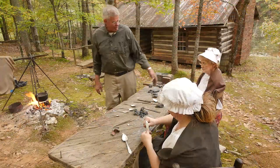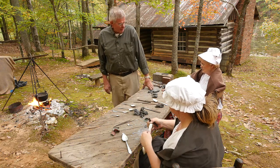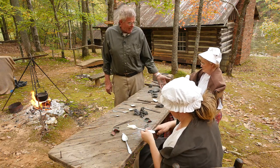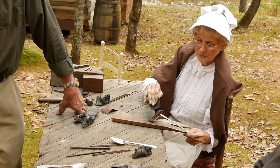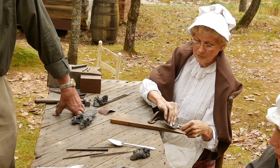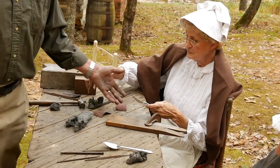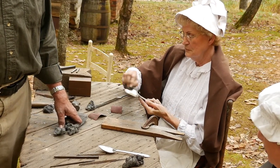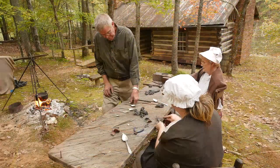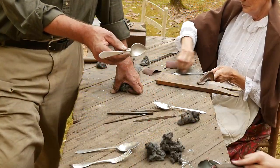Then we come down here — once the flange is off, they start with sandpaper. You can do it flat, or lay it in a cradle — a lot of people lay them in a cradle, a lot of people lay them flat on the table. It just depends on how you need support. Once we get it from the nippers to the sandpaper and the files, then we start with steel wool, and it comes out looking polished — a good spoon that a lot of people like to take home as souvenirs.